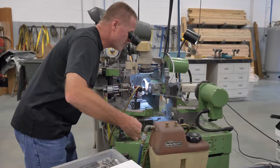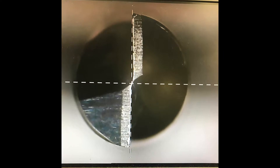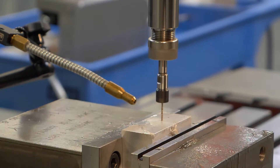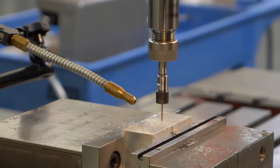At this point the tool bottom is examined prior to going back into the now conical hole. Back at the CNC mill, a few more pecks with the flat bottom drill and the cone at the hole bottom is now removed — the hole is made dead flat and brought into final depth.